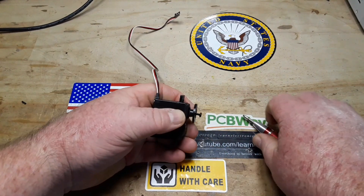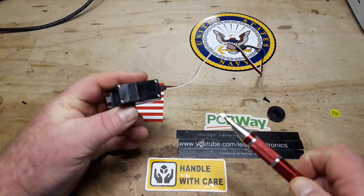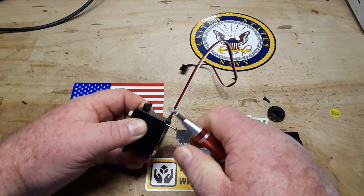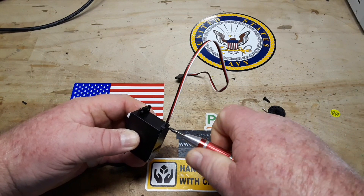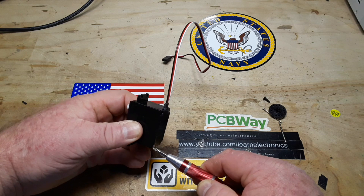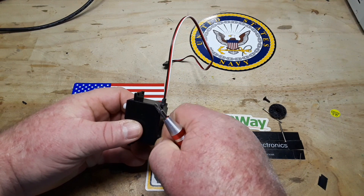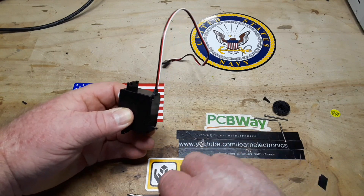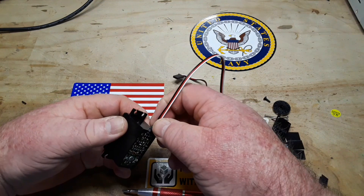If you've never messed with servos, you can see what the inside looks like. If you're wondering what servos have to do with electronics — well, if you're a maker, you know servos are used in lots of electronic products. Basically what we've got here is a small DC motor with end limits, so it can only turn so far one way and so far the other way. Then we have a gear reduction system to slow down the speed and increase the output torque. Servos are incredibly useful when you're building electronic projects and you need to move something — not locomotion, but what you'd call a position-type motor.